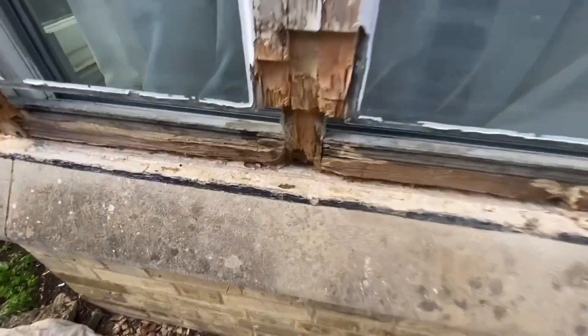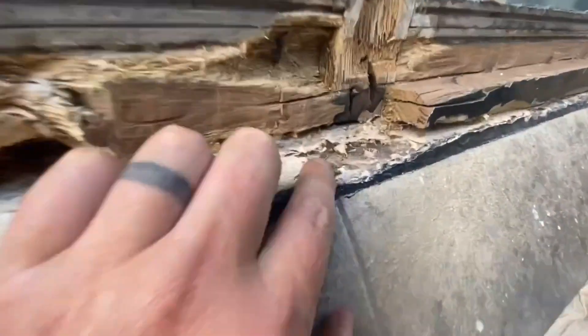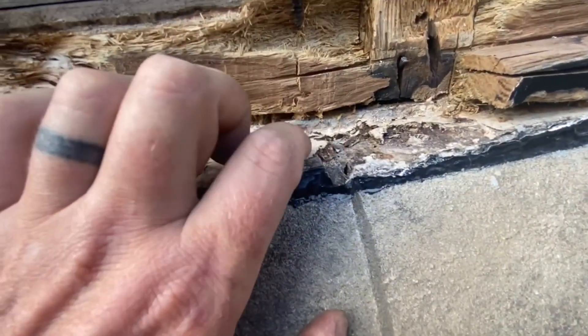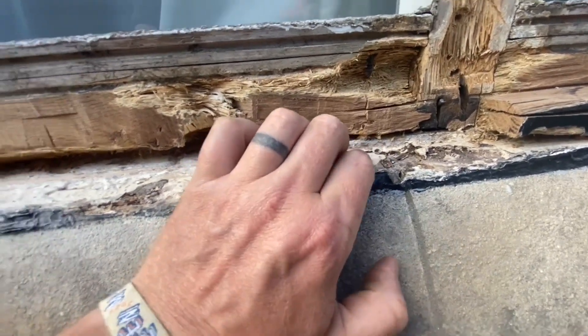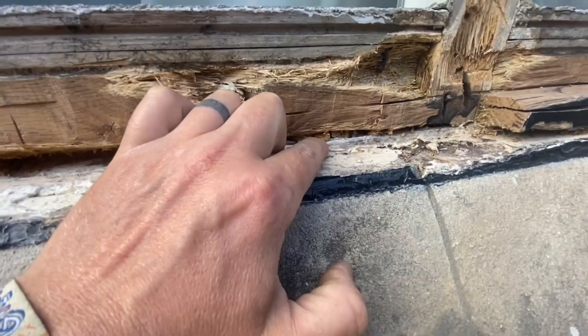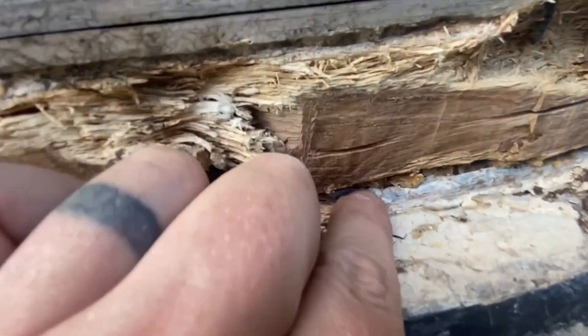I was chopping and chopping and just look at this — that's mould, that's spores, that's fungal growth. It's white and powdery. I was always led to believe that's dry rot, and when it's darker and spongy, that's wet rot. But I've got both — this is soft as well. I can feel the spores on it, pretty rank really. I've got to remove more of this, put fresh bits of timber in unfortunately, and it's quite a lot.